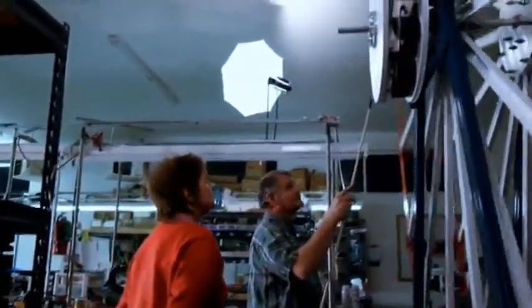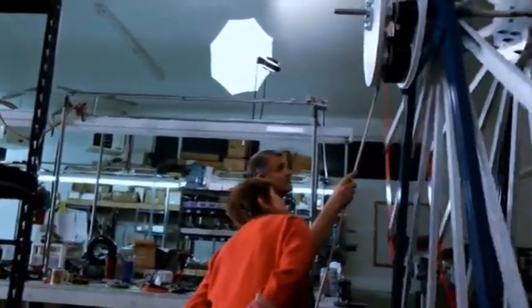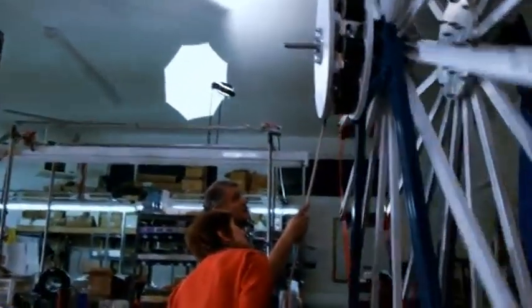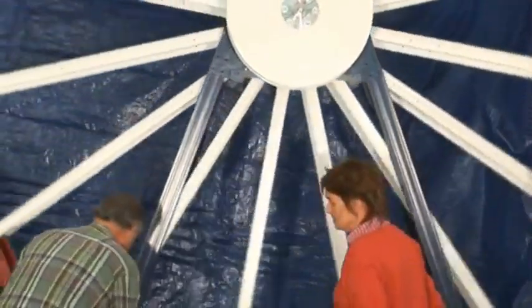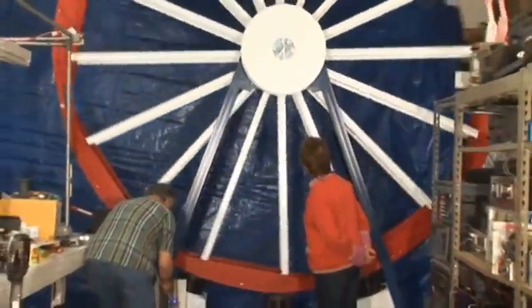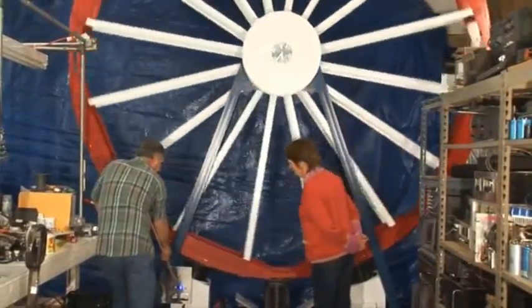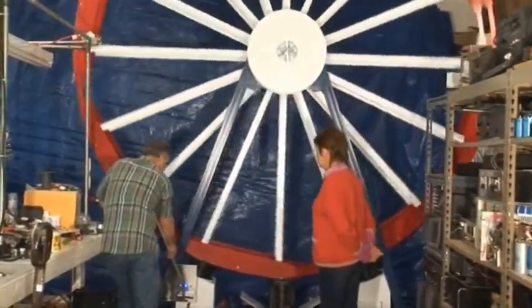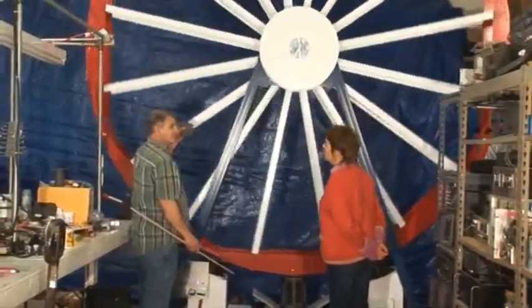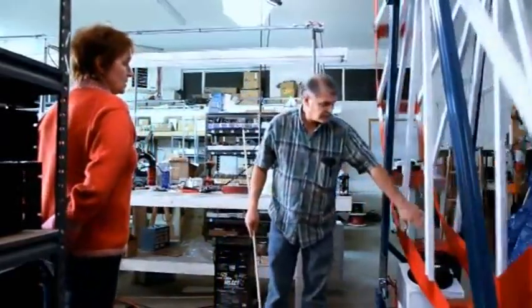The next thing that happens is it gets the impulse here — that little impulse — and it shakes. But when it turns itself around, it's attractive because this is still energized, and that's the energy coming from the flip. The magnet produces the long blue pulse, and that's the motor itself — that's the force that's pushing this wheel around.